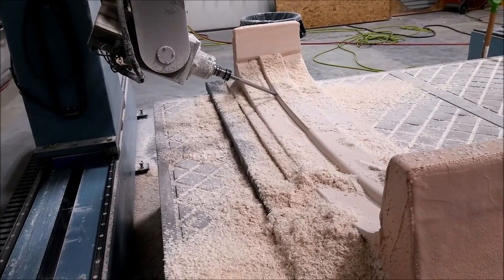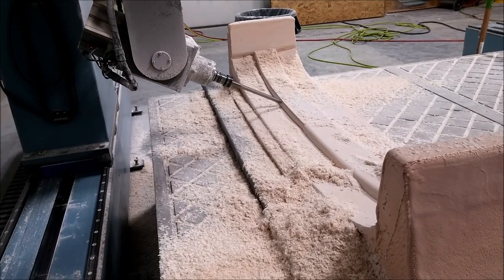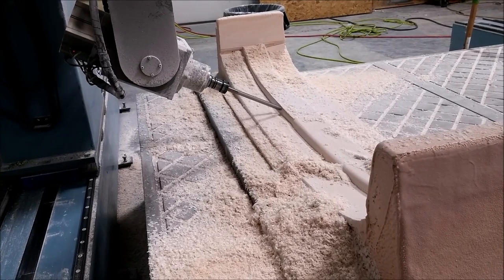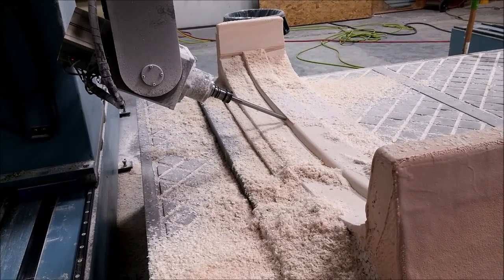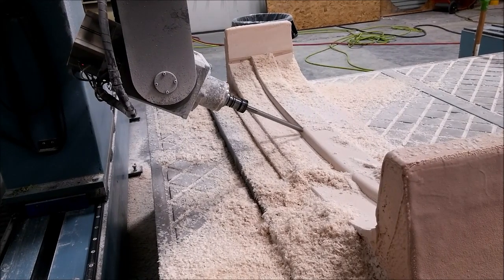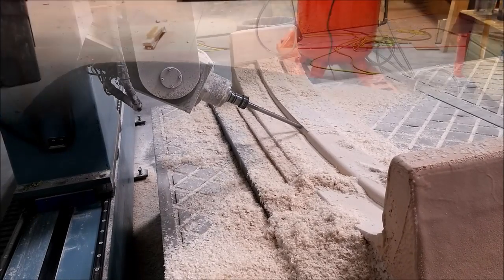Welcome back — here's the update for the first part of this week. On Saturday I was in the shop milling the floor braces, the new floor braces, after we removed the conduits out. This is just running the long end mill and cutting the radius on the edge of the brace.